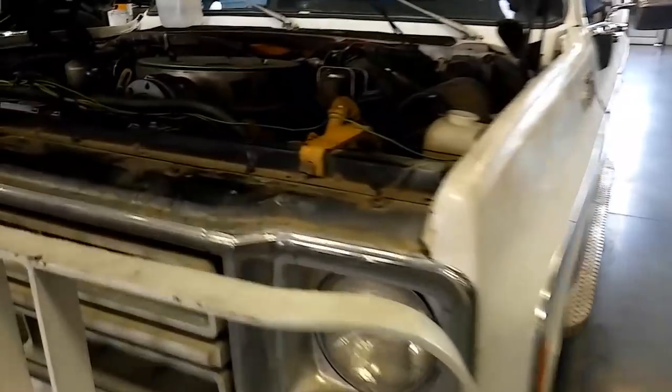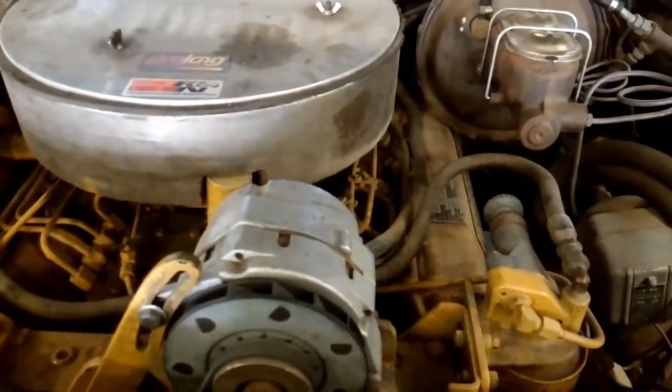So let's start with the basics on this engine. The 3208 is a diesel V8 arrangement that was designed in the mid to late 70s by Caterpillar, and it had a production run from the late 70s through all of the 80s into the early 1990s, at which point, since it was a mechanical-only engine, it was getting phased out by the 3116. I've only worked on the ones in generators and trucks. If you have a truck or RV one, your serial number will range from 02Z, 32Y, 40S, or 51Z. This was a 636 cubic inch engine — 10.4 liters.